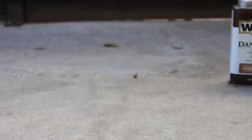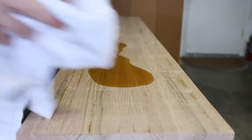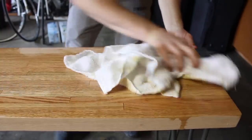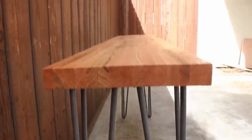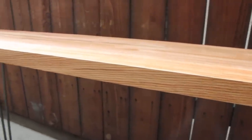For finish I am using a natural Danish oil. I like Danish oil because it protects the wood really well especially for indoor projects, brings out the natural grain, while still allowing you to feel the wood. After two coats and 24 hours of curing I was done. And man did this thing come out awesome. I love the butcher block look mixed with the hairpin legs — it looks super clean, very minimal and modern, and makes all of the labor well worth it.